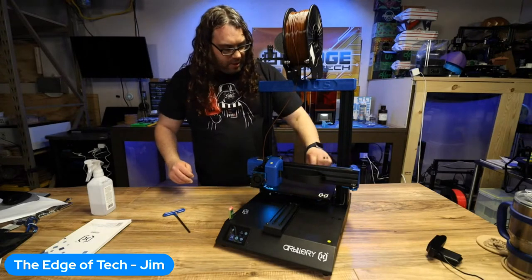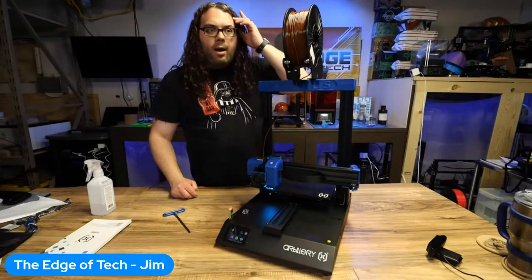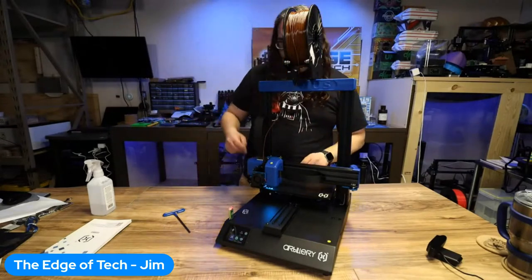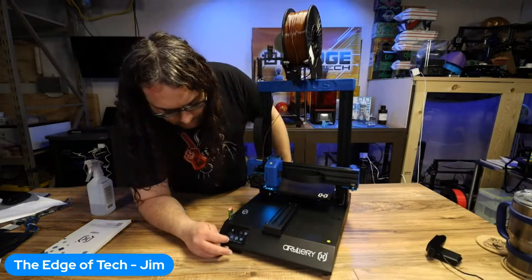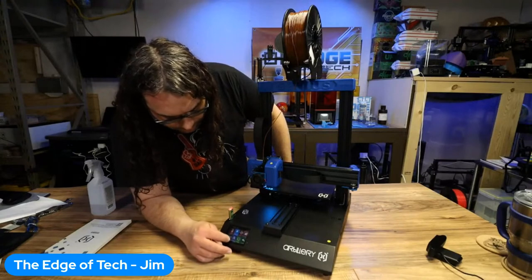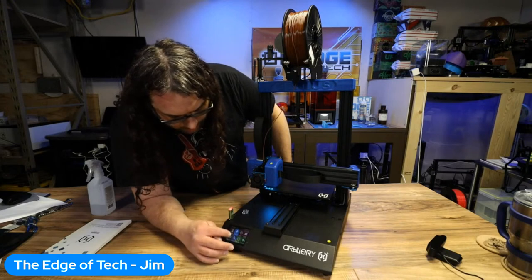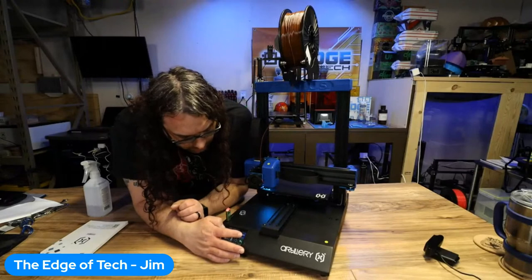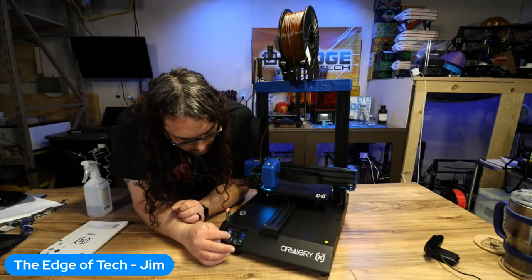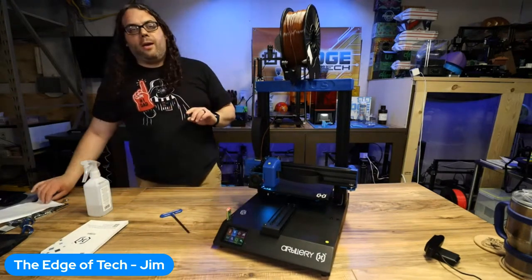Yeah, the ribbon cables are, some people love them and some people hate them. No auto bed leveling. 220 by 220 by 250 is the... I'm going to level this thing one more time here. Why not? Obviously, it's not sticking, so there's that. But there's no baby stepping, which I'm not a fan of, you know? And when I stopped this, the heat didn't go down either. Just for everybody to know.